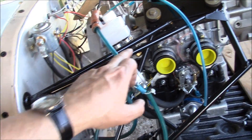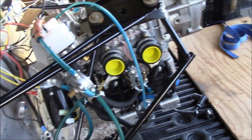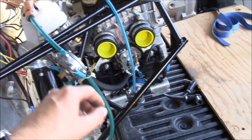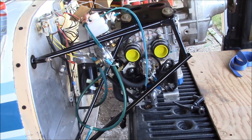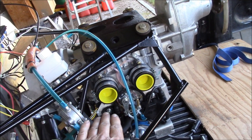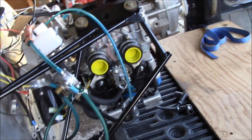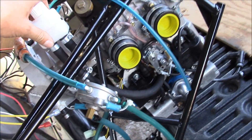I also decided that this tube here is not normally in place, but for the sake of a few ounces of weight, put that in. Dan at Snowbird figured out that was a good idea - this was his idea to put that in. So there she is. The only downside is if I've got to change anything on the slide on the carburetor, I've got to pop it off to get the cap off - that's the only little downside. But for three minutes of work, who cares.